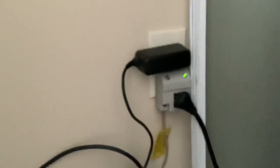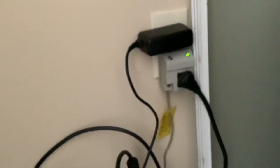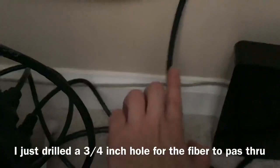Another quick step — not mandatory, but some people say it helps: grounding your ONT. This is relevant if you live in a multi-dwelling unit and don't have access to the outside ground. You get this grounding unit — I don't think a lot of new installs have them, but mine did, so I brought it in here. You can probably buy it online. I used a staple gun and put a few staples in because the wire is pretty rigid. Put a little coax grounding there — I trimmed a custom coax cord. It doesn't seem super necessary, but people say it kind of helps a bit.